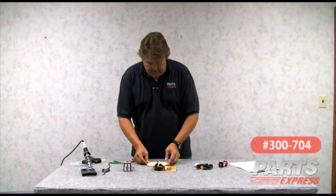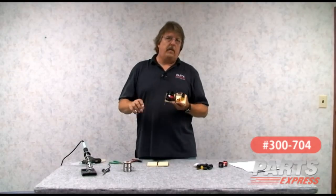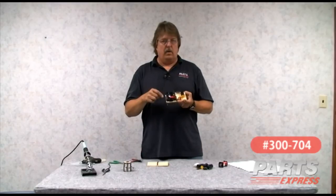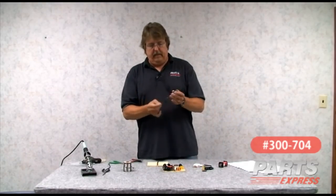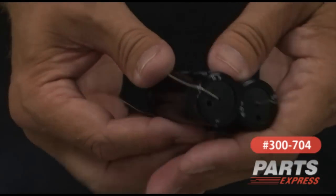The first parts I'm going to add amount to a high pass filter to control the bottom end response of the woofers. This is not required if you're doing the mass-loaded transmission line — it's only for the center channel or the small sealed version of the Aviatrix. To put these in the circuit, these two capacitors are wired together in parallel. If you're doing the MLTL version of the speaker system, you won't add this circuit to your crossover.